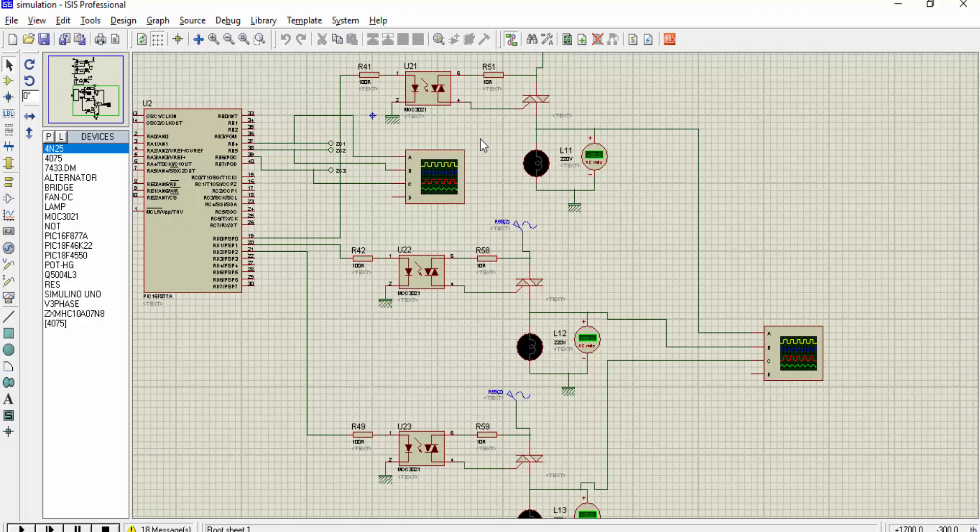Let's see what is the function of a soft starter. A soft starter is basically a device which controls the current or speed of an induction motor. It allows the motor speed to increase gradually from low speed to higher speed, and similarly the current will increase from a low value to a high value gradually. We can control the speed or current by providing a gradual increase in voltage to the three-phase induction motor.